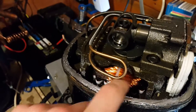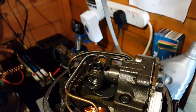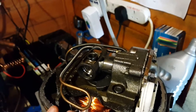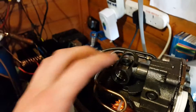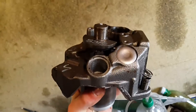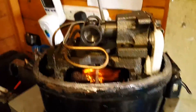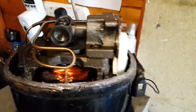Or I may even be able to just replace the motor completely. The only issue is that means the rotor must go as well. And how am I going to be able to lubricate it? Because these are lubricated by a hollow rotor — there is actually a hole that goes right through it. I have got another example of that from another one. So you cannot just put any motor in it. You are going to have to try and rewind the existing one, which I am going to try and do. I may even be able to recycle all that copper.